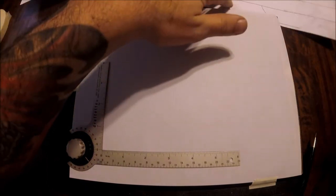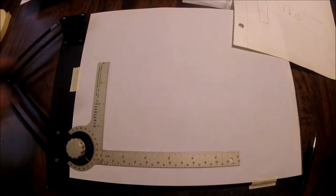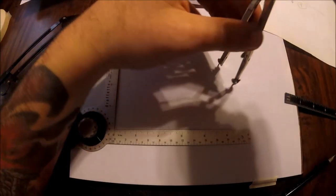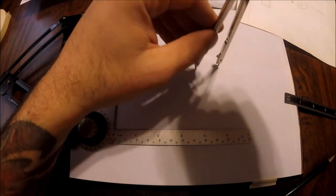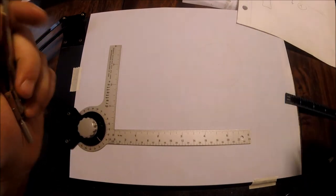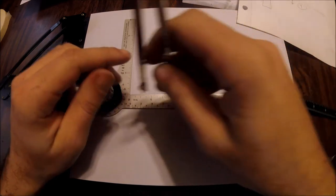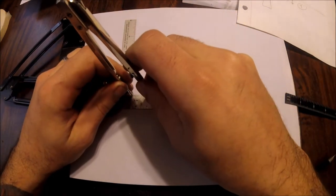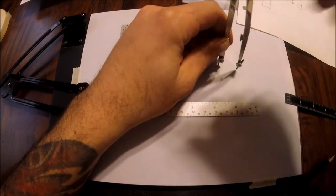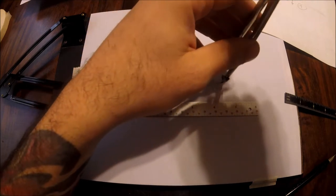Looking at our information: stop outside diameter is two and a quarter, so the radius is one and an eighth — that's the outside of our flange. The working bore diameter of the stop is one and three-quarters, so the radius is seven-eighths. That's what we're going to be boring this block out to. Pretty much what I'll do is get this hole in here in the lathe with the four-jaw chuck, drilling out until I get close, then run the boring bar through to hit 1.750 inches.